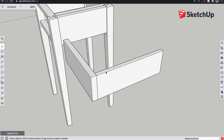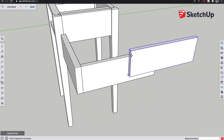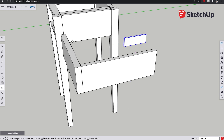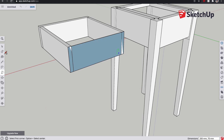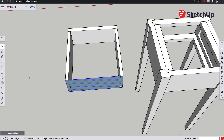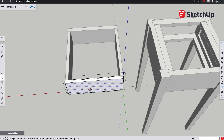Using snap tracking — just highlight over that for a second and bring it over — it's going to snap on there and you can see there's a little green line showing that that's in line with the top of the front of the drawer. Bring it back and then down to complete the component. Let's highlight that and make this a drawer side, then extrude this to be about 10 millimeters. So we'll also make the drawer back — it's going to get slightly thinner from top to bottom afterwards, but we'll make it full size for now and make it 10 millimeters thick as well.